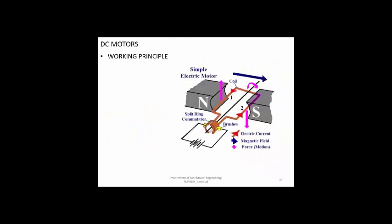Another important concept is the back EMF. Whenever there is a change in magnetic flux over a conductor, an EMF is generated which causes current to flow. The direction of this current and the back EMF will try to oppose the movement of the flux itself. The magnetic flux goes from north to south, and when force is generated the conductor tries to move. This motion of the conductor in the magnetic field generates an EMF - called the back EMF - which opposes the initial current.